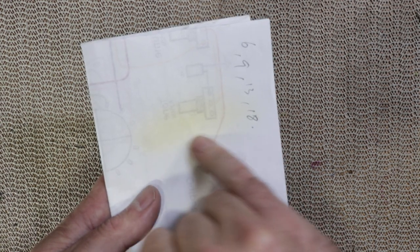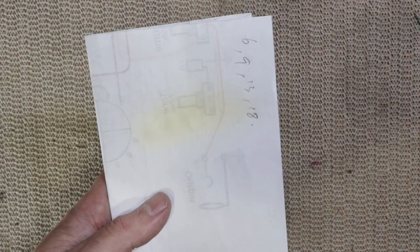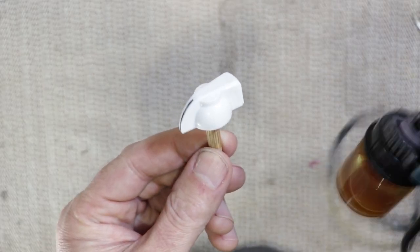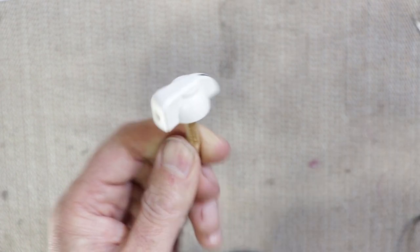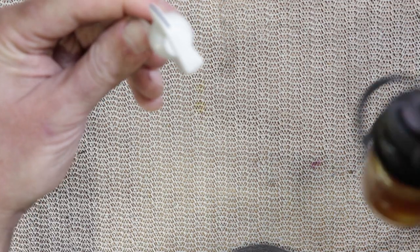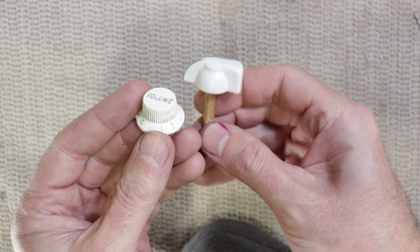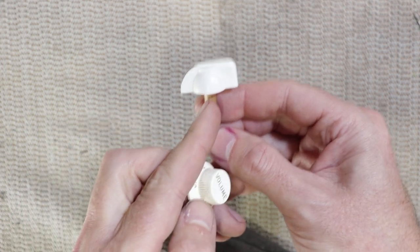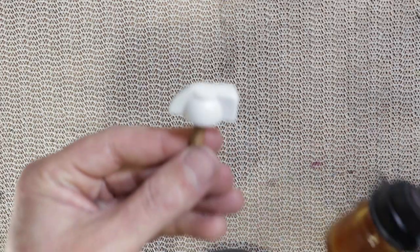So what was that — 4 or 5 passes? I think you can possibly see there's just a slight yellow mark there on the white paper, so I reckon that's about ideal. Yeah, I think it's very close — it needs just a tiny bit more shellac. That's basically dried instantly because it's so thinned with metho. I'm just going to touch that once again.